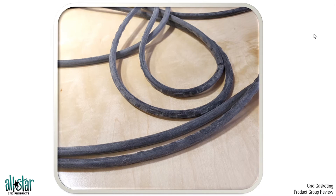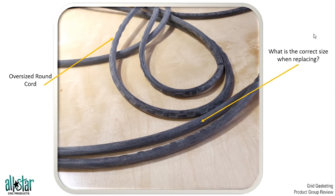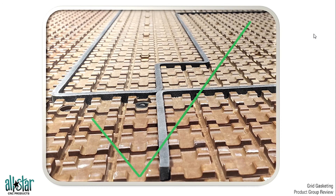We can see when these round cords come out of these channels, the oversized cord gets mashed and dented because it's not the right fit for that channel. And then when customers go to replace that material, what is the size they're looking for? What is the cord that we had? So in our opinion, the best way to do it is a squared gasket. With that same quarter by quarter channel, we are going to use our industrial equipment here to cut gasket to size — a quarter inch wide to fill that channel width-wise evenly, creating a consistent surface, cut to a 5/16 height to stick above by that 16th of an inch that we're looking for. Here we have a very consistent surface, very consistent seal — a much better option for vacuum clamping on your CNC router.